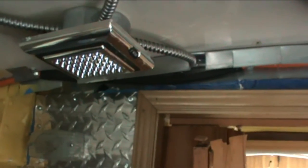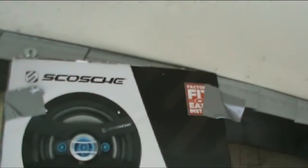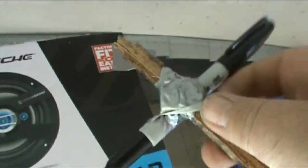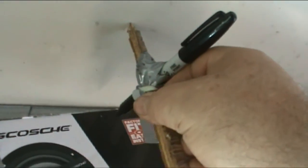Well, it's actually pretty simple to do stuff like that, and I'll show you how. Suppose I wanted to cut to the contour of the ceiling here, which I will be doing soon whenever I do this front area. So what I did — this is our future template here — I taped it in place. I went out and pulled a scrap piece of wood out of the scrap wood pile, and I duct taped it onto a marker. And now what I can do is lay this along like this and move it down, and that's going to write the contour.